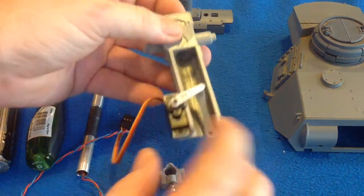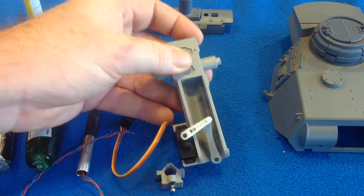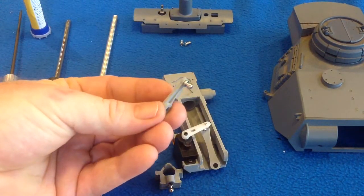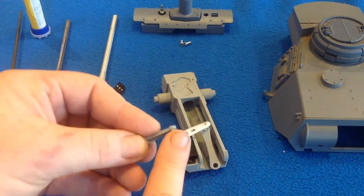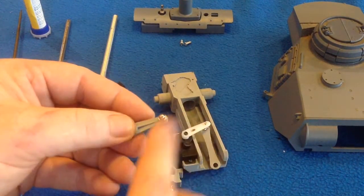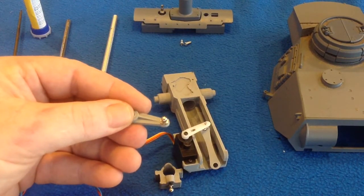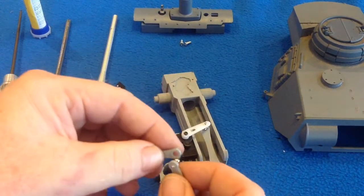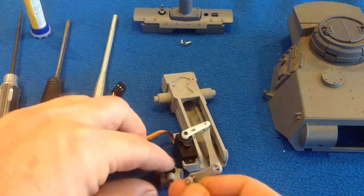So, you've printed your part and attached your servo. If you don't have a DS-65 with these long servo arms, print yourself out one of these 2.5mm servo arms. All the fittings here use 4mm balls, so if you're using my stuff you'll need to get some 4mm ball studs, which I hope will be in the shop shortly. Print out some links — the beauty of these is they just snap on to your ball.